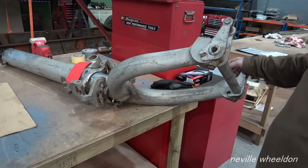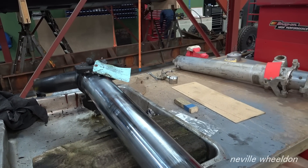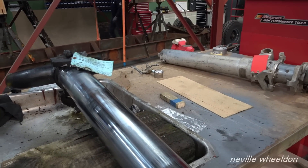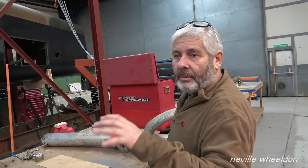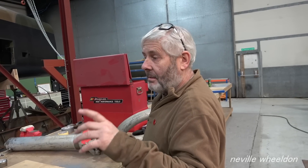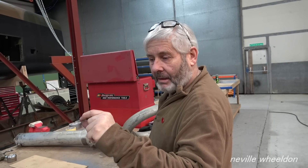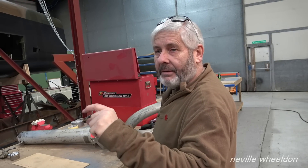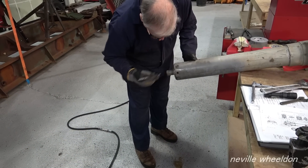Just James's rear wheel unit is on the left, the spare unit on the right came from Australia. It's just a pot full of oil. Every time it does shimmy it chucks the oil out overboard — just like a thermal relief valve on it. There's a plunger in the bottom, and as it gets used and the oil goes down, the plunger goes into the unit. You have to make sure the plunger is fully out every time you go flying — then you pump hydraulic fluid in to get the right pressure, and the thermal thing opens and chucks the excess overboard.